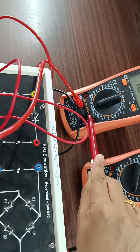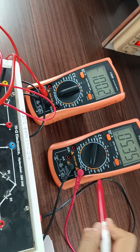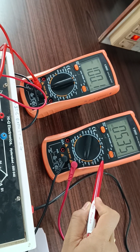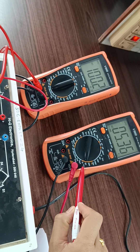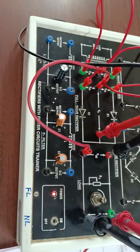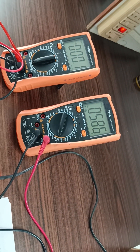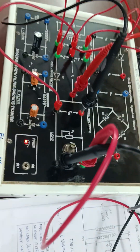This is the Idc value — you can identify which value it is based on the symbol: this indicates AC and this indicates DC. For no load condition, rotate the potentiometer completely to the right side. Note down the corresponding four readings.